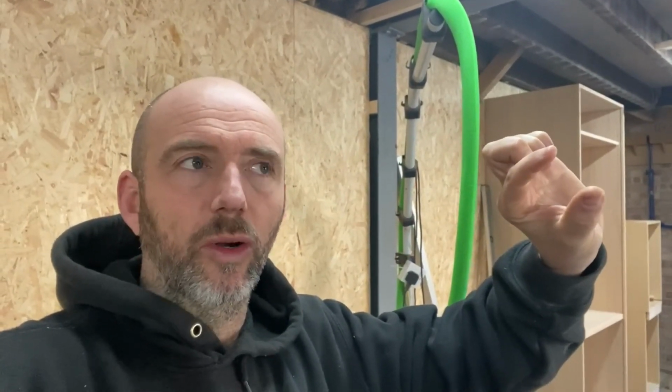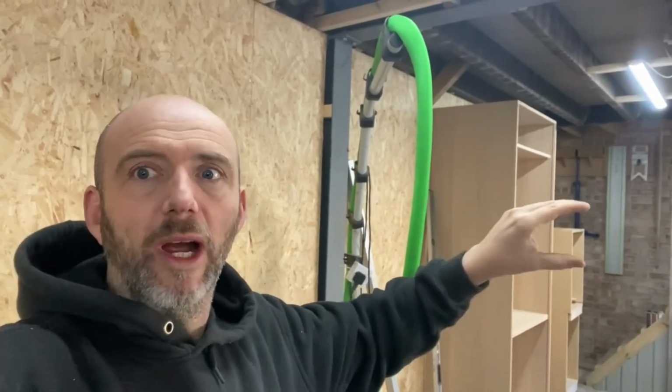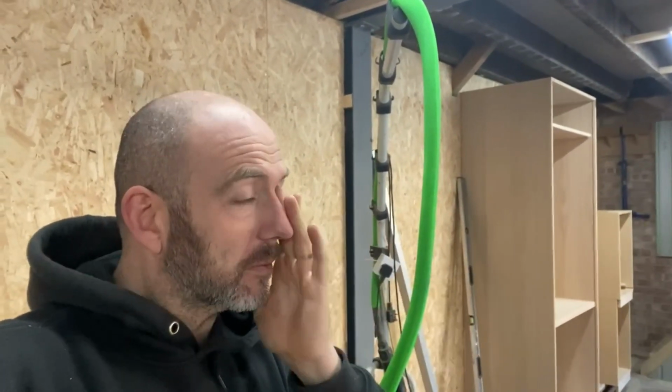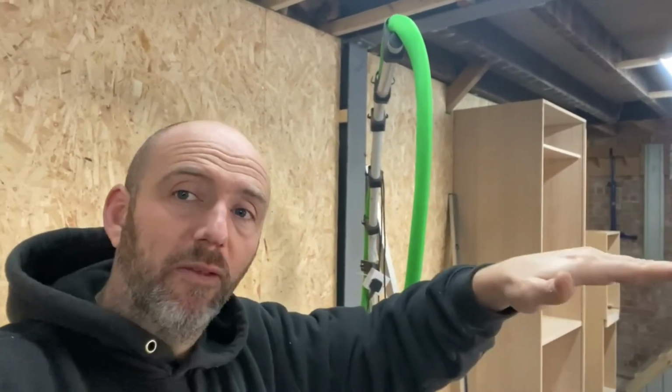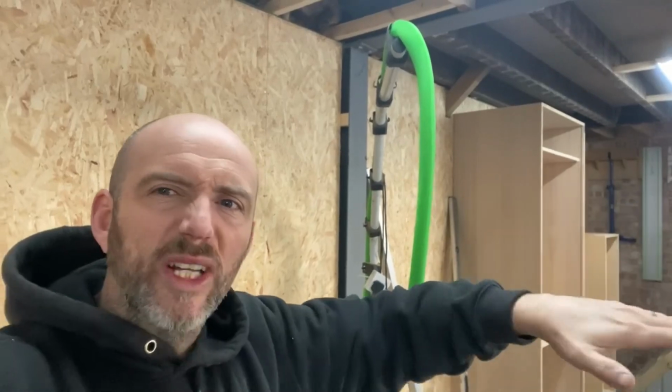I do prefer it for a floating shelf because the way you actually do it is quite a lot of glue contact on a 19mm board at a 45-degree cut wrapped round. There's quite a lot of pressed glue contact there. When it wraps all the way around, it's doubled, so that forms, in my opinion, quite a strong engineered bond along the front. And obviously you have a continual batten, which also makes it strong and takes the whip out of it, because MDF has quite a high self weight, so it'll have a high sag.